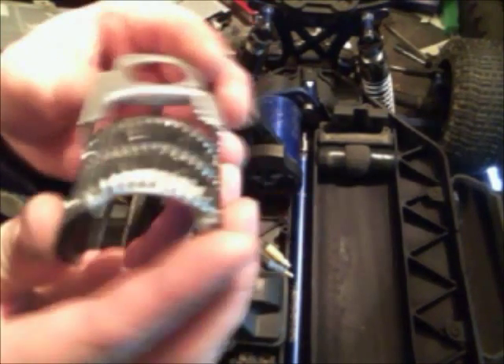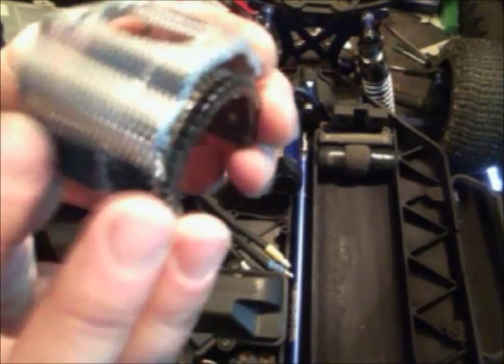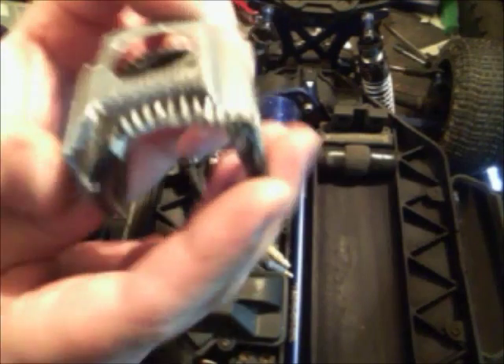With mine already kind of pretty and bent, I drill the hole out for the fan, add some screws, and then this will just slide right onto that. So on top of that I'm giving my heat sink more metal to let the heat dissipate into, and it's got tons of little holes for the fan to just blow cool air through the whole thing.